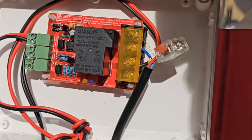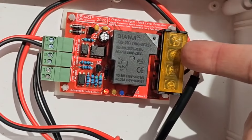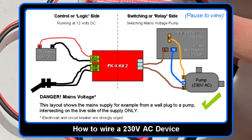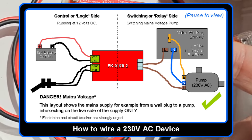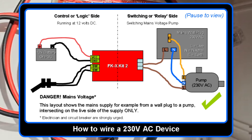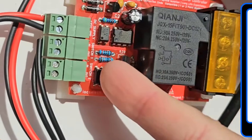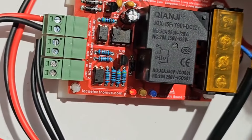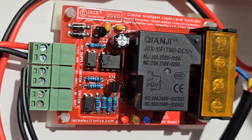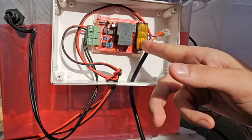You don't need one that large, and you can have the battery connected to a solar panel if you wish. Even if you're switching mains voltage on the relay side, only ever put 12 volt DC into the supply side. We have had people power these kits using a small 9 volt PP3 battery — the same as in a smoke alarm — but we don't recommend that because it's a small battery and the voltage is on the low side. This board is supposed to have 12 volts. It has polarity protection, flywheel protection, and other protection features built in. We'd recommend using a small car battery, leisure battery, 12 volt transformer, or other stable power source.